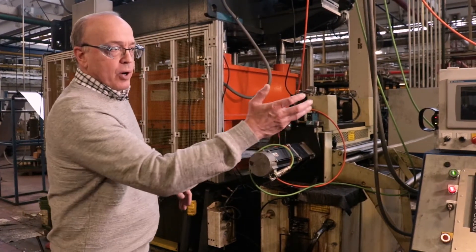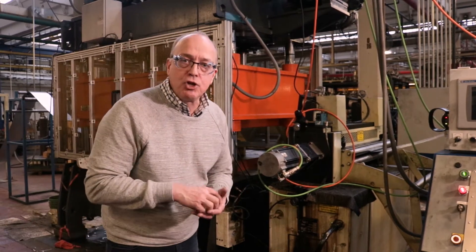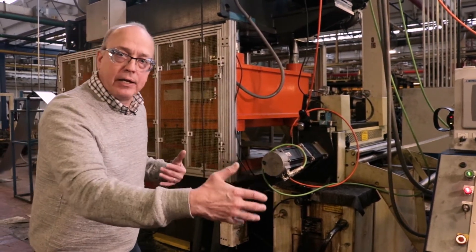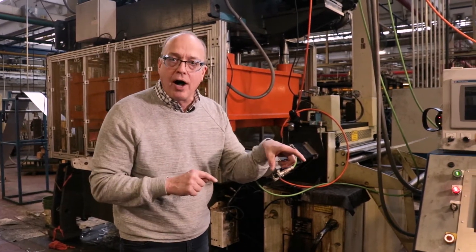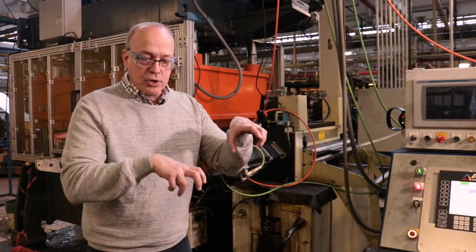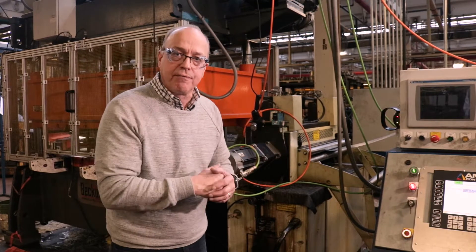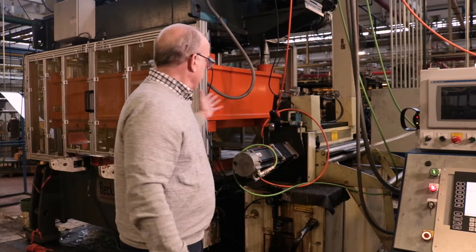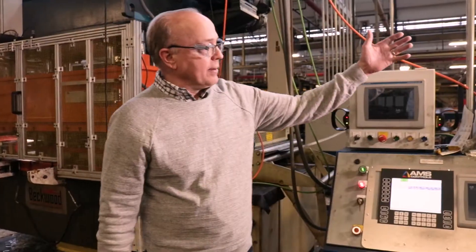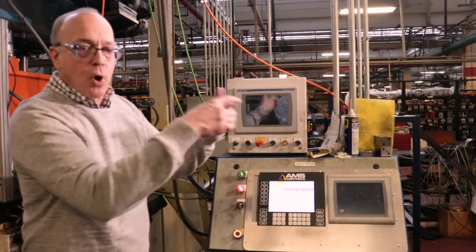Once the material is positioned, the press stroke makes a hit and the material stops for that moment. That's why we need the slack loop at the beginning, and we'll have a slack loop after the punching as well. The die is pneumatically controlled — it's about 30 inches wide by about four feet long, and there are different features in that die that we turn on and off with the control system so the patterns can be flexible. We'll move the strip and hit two or three punches, then move it again, turn those off, and hit two or three others. That combination of patterns creates the flexibility in the pre-punch. From here, the accurately punched material heads to the next process — the actual roll forming — again using a slack loop to control the material while the roll form mill is moving continuously.